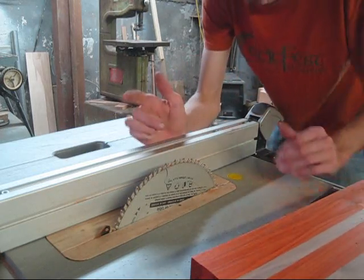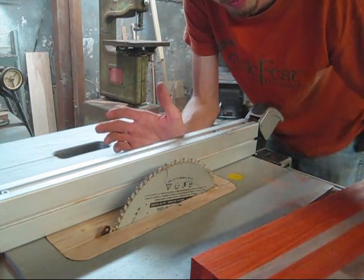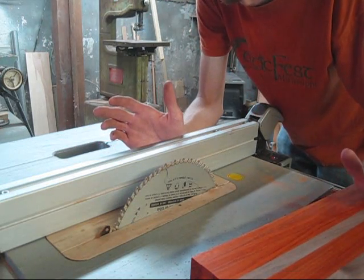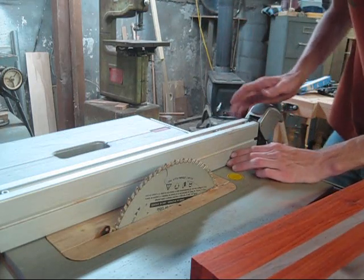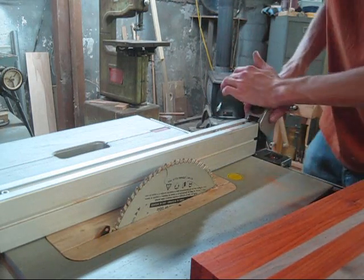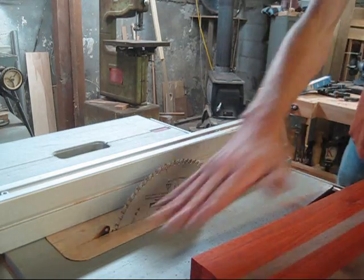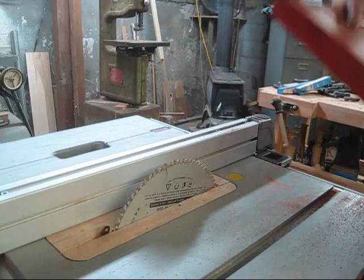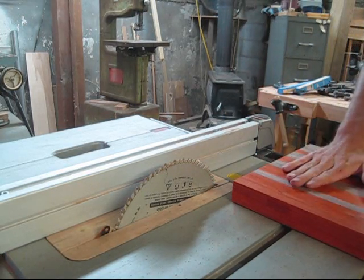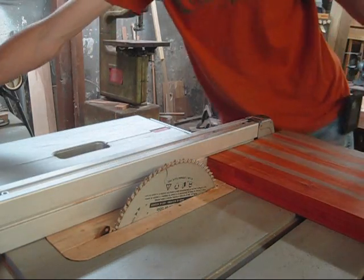Our desired goal is 1.5 inches, but we're going to have to level this board once we make it. And the only way that you can level end grain is, well, I won't spoil it yet. We'll get into that soon. But 1 5/8 inches for a rough cut, and you should have plenty of stock to have enough equal blanks to do our pattern. So go ahead and start ripping those.